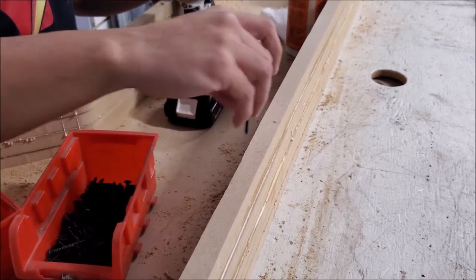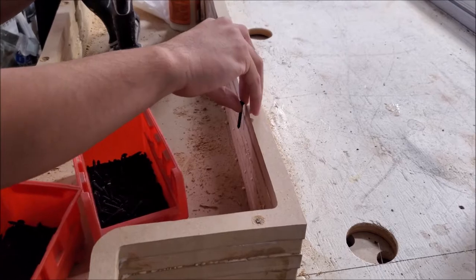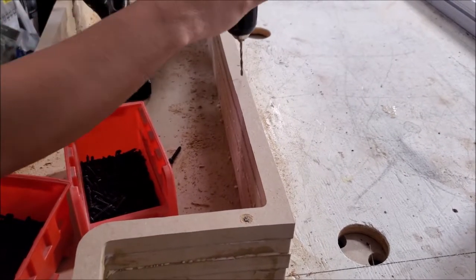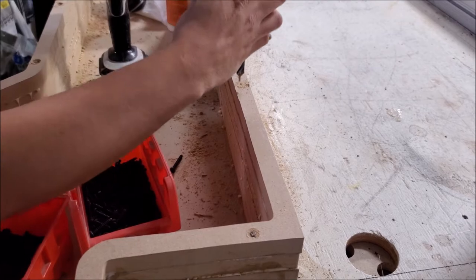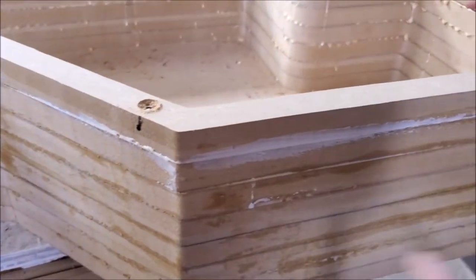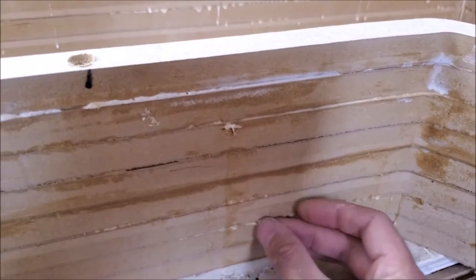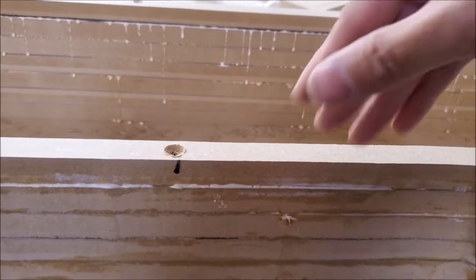We're offsetting the screws — on one set here, another set there — using a screw length that hits three layers at a time. With shorter screws on the bottom, everything is clamped three at a time for full clamping force. We pre-drill, countersink, then screw. With each layer we wipe off the glue as we go because it dries quite quickly. For the final layer we mark where we've put in the screws so that when we put on the main baffle we don't have excessive holes.